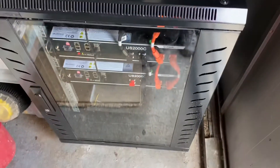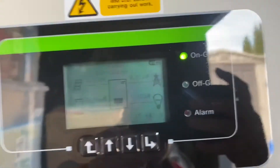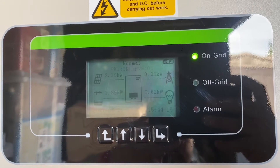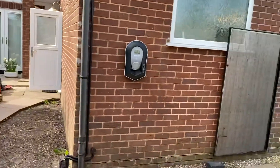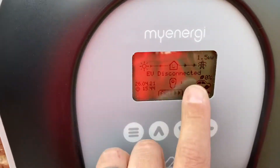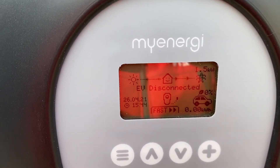Along with a set of batteries. We're just going to turn the batteries off and see what happens with the charger. You can see we've got zero energy going back into the grid, just a trickle now and again, and everything's been sucked up by the batteries — 2.2 kilowatts produced by the panels. We'll just turn these batteries off and go back over to the charge unit to see what's being produced. You can now see from the solar install, 1.5 kilowatts being pumped back into the grid.